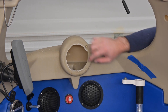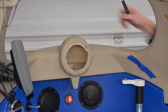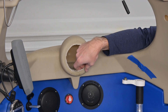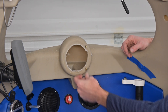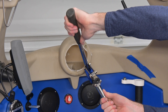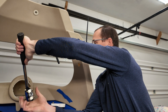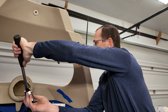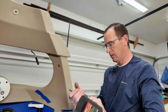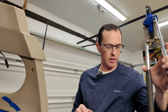You can see our spot there — just let it eat, that's it. You don't want to do any more than that. Make sure the rivet nut fits, put it in the tool, and just as it starts to get easier you start to yield it. Back off again — okay, we're done with this one. One more dollar bolt and things get easier from here.